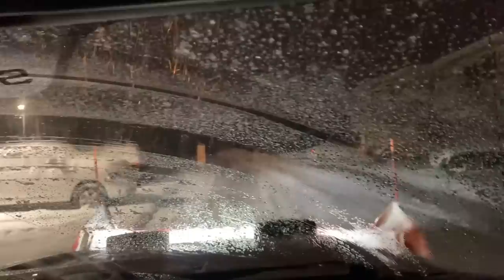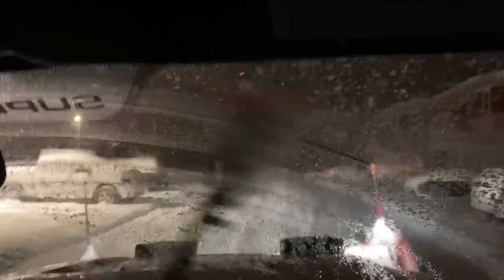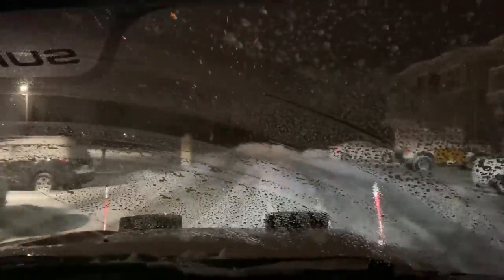Just keep plowing it up as high as we can, raising it before we get to the grass so we're not damaging it — leaving a thin layer really makes a big difference. If there wasn't as much snow here I'd back-drag a lot of this stuff first, but with this much snow it gets hard on the truck for traction. Raise my plow right when I get to the marker. Here's where I gotta be careful — the well cap is somewhere back there. I should have marked it, but this is my first year plowing this place. I'll definitely be marking that in the future. This is also where Google Maps can come in handy — you can see satellite views of where things are roughly, like whether a lot has parking curbs.